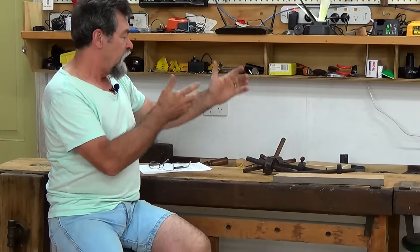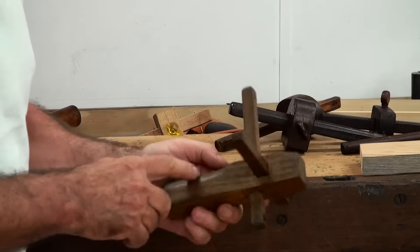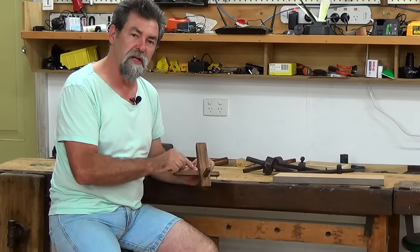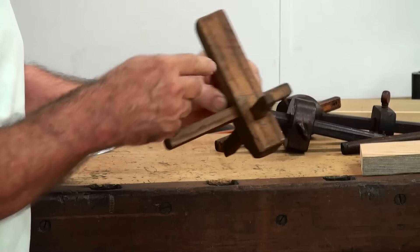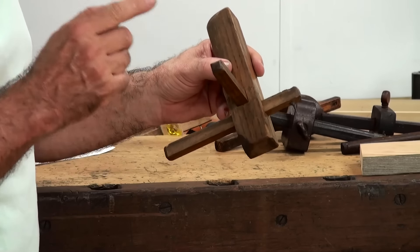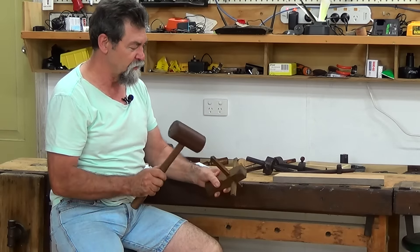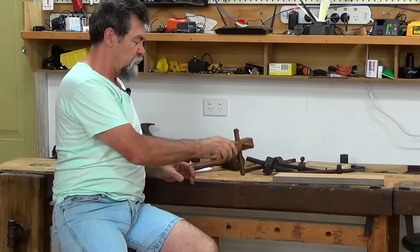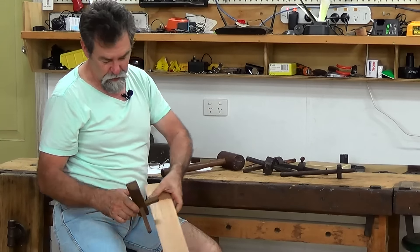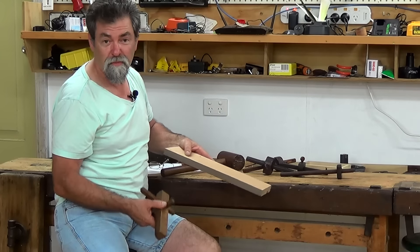Then he's got this one — I think this is a homemade one. I don't know whether Arthur made it or one of his descendants; maybe my uncle made it. It is designed so that both beams actually touch each other in the head. The headstock is basically a shaft with two mortises in it, and the beams are acting as tenons. When you put them in, it creates a tight fit, and you tap them along to where you want. You end up with two units of measurement already on the one tool — that's pretty cool.